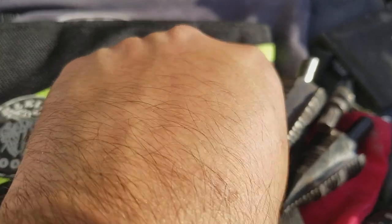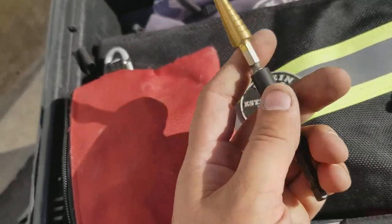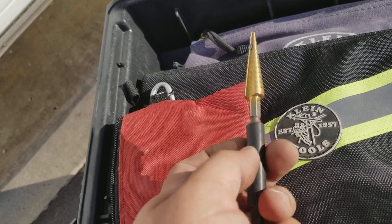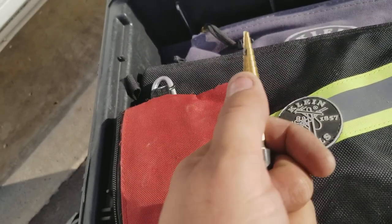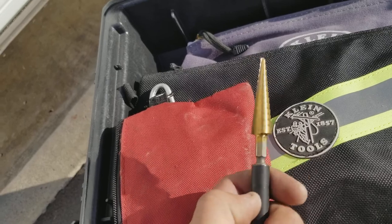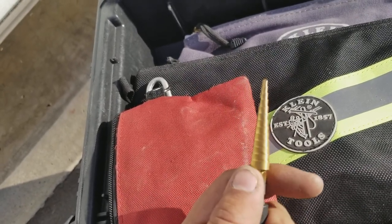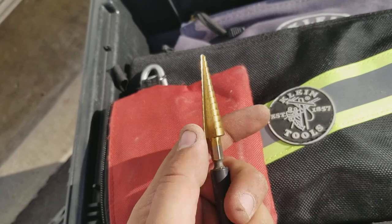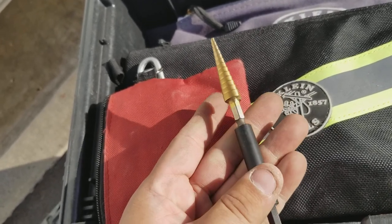This is my favorite attachment. This holds really good — I use this for mounting TVs. I drill through the stud and make a hole in a commercial setting with a metal stud, then push in your toggle and it grabs onto the back of the beam. It's not just drywall holding the TV — most people just attach to the drywall which is not the right way. This will hold up a TV during an earthquake or even just someone pulling on it. It's the right way to do it.